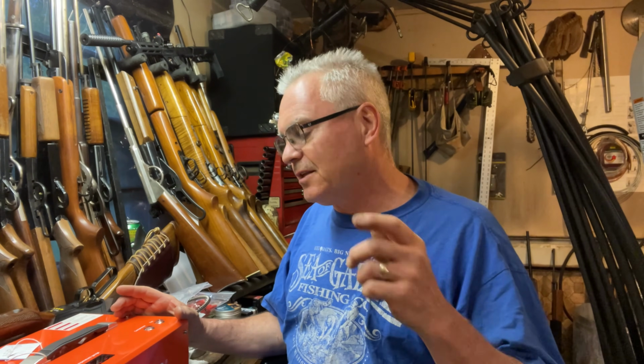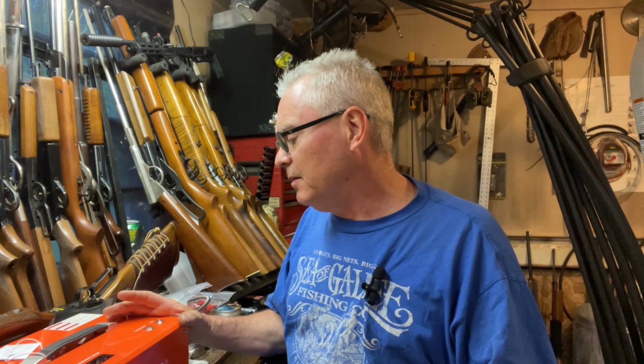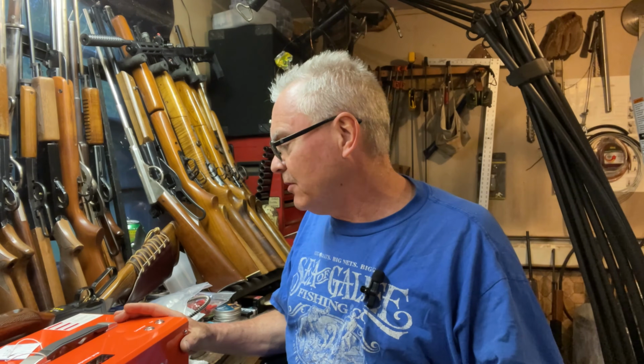But anyway, I set that up for 4,000 and started it running, and it took exactly 18 minutes to pump that from just a touch above 3,000 all the way up to 4,000 psi, and the temperature gauge never went above 31 degrees Celsius, which is about 83, 84 degrees Fahrenheit, which was only a bit above room temperature of what we have going on here. So very impressed with that so far.